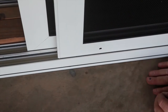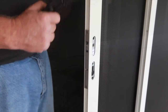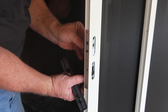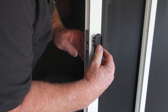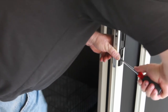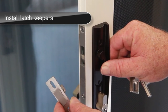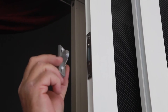Install the adjustment screw caps over the wheel adjustment holes at the top and bottom of both doors. Install the handle hardware on the active door panel, starting on the interior of the door panel. Insert the spindle and mounting screws to the mortise gear. Align the other handle on the exterior of the door and drive the mounting screws, leaving them loose one or two turns. Insert the single deadbolt active lock door cylinder from the inside of the door through the handle as shown. Insert and tighten the retainer screws in the edge of the door panel until snug — do not over tighten. Tighten the two handle mounting screws until snug. Use the thumb turn to engage the three-point locking mechanism so the throws are deployed from the edge of the door panel. Note that the shorter latch keeper is used in the center of the door, with the two longer ones used on the top and bottom.